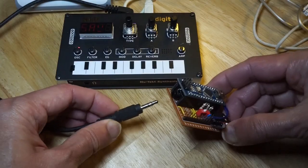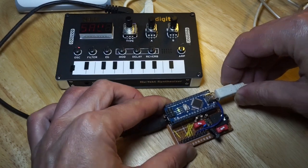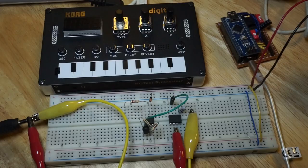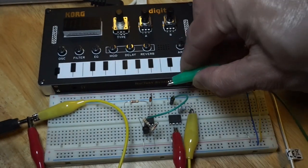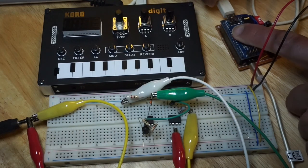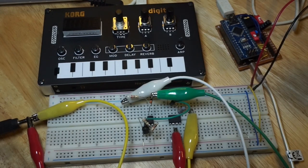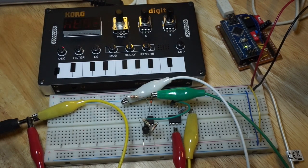I tested this circuit with actual MIDI data. An Arduino Nano clone board generates a simple MIDI note test sequence for passing to the optocoupler. The output stage is buffered using an LM358 op-amp before being sent to the MIDI in port of this Korg NTS-1. The Arduino board and NTS-1 are electrically isolated from each other using the PC817 optocoupler.